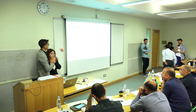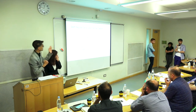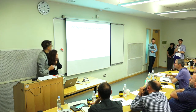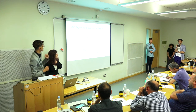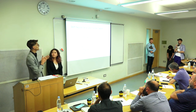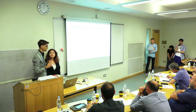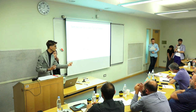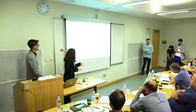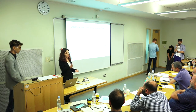Then after the first one, we insert a 0 next to the bit, and you see that the value of 1 shifts to the next pin, and then we compare that to our Braille code. In this case, it's different, hence we don't have an enable input. The amount of time that we keep the enable input depends on how much time is necessary for the actual physical pin to be pushed. With our experiment, what we achieved was that a 10 millisecond impulse was enough to push the pins up or pull them down.